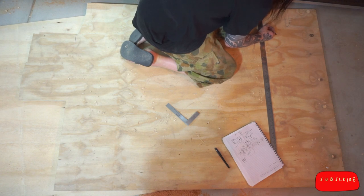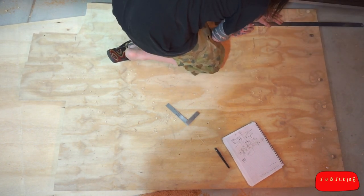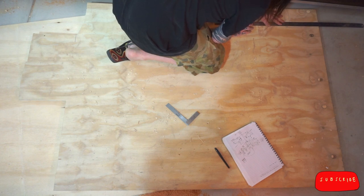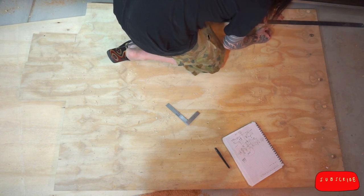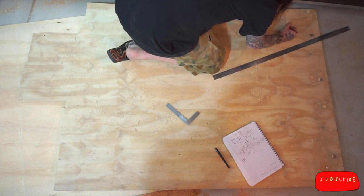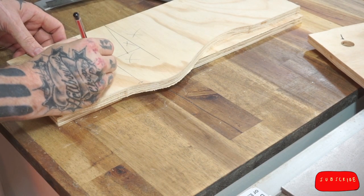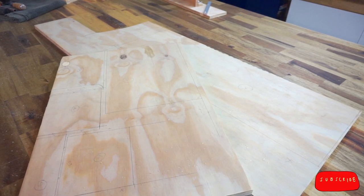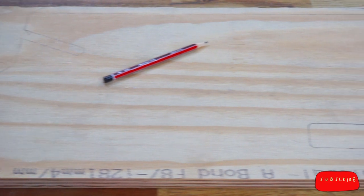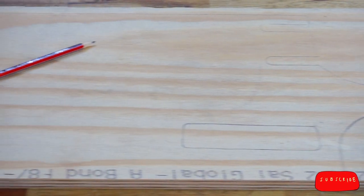First thing to do is decide which version you want to make. The best thing about making jigs is you can call the components anything you like, so I went with ridiculous names that are misleading and confusing. In option one, the tock panels — items A and J on the plans — are curved and you can make and layer as many as you need. In option B, the jig is a bit more streamlined, with big rectangular tock panels that you only need to make two of. Once you've decided, grab a sharp pencil and a highly accurate ruler and start marking up. Put the tape measure down — you're a luthier now. It's better to be as careful as you can at the start; then the finished jig will fit together so much better.